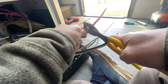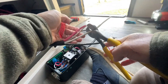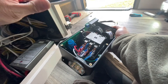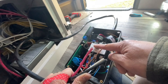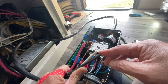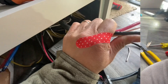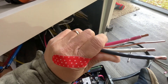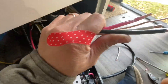Wiring this is really just basic — red to red, L3 to T3, L2 neutral to T2, and of course black goes to L1. Let me go ahead and strip it. About the hand — I was doing another project inside the house and the attic ladder pinched me, so oh well.